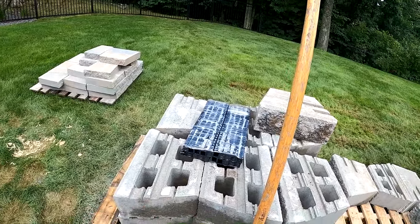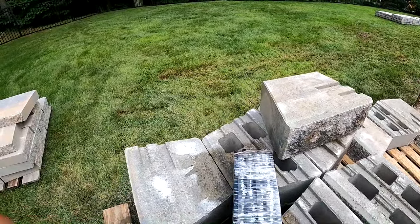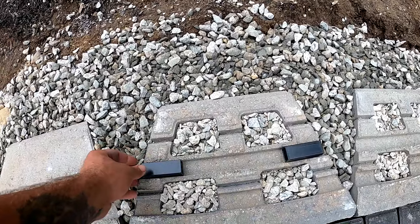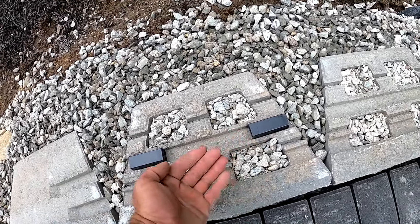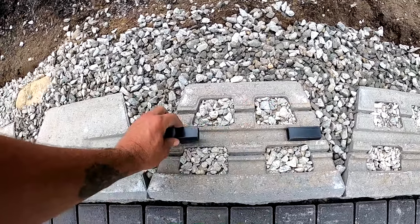The Techo-Block Sema wall blocks are 16 inches long by 6 inches high and 11 inches in depth. They come with interlocking plastic pieces — this is how they interlock. This wall is made to either have a one-inch setback or run straight up vertically, which is what we're doing. Depending on where you place these tabs, putting them in the middle keeps it straight; putting them in the front gives you the one-inch setback. We'll be using the straight up-and-down technique because this isn't a retaining wall — it's just going to be three rows high for a sitting wall, nice and straight with a cap that has an inch overhang.